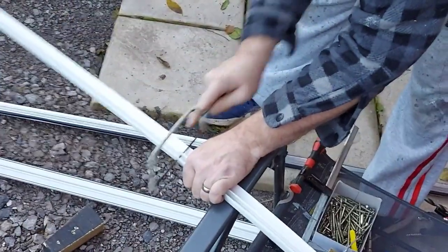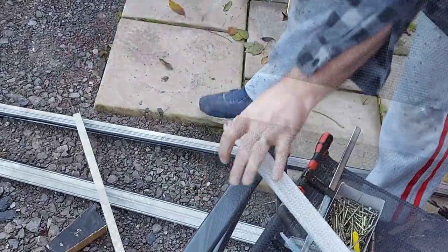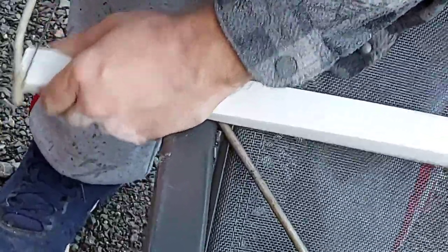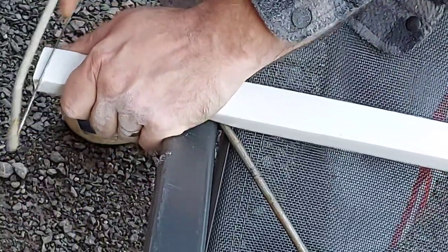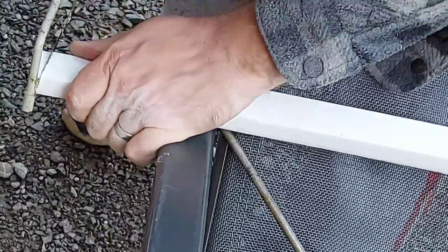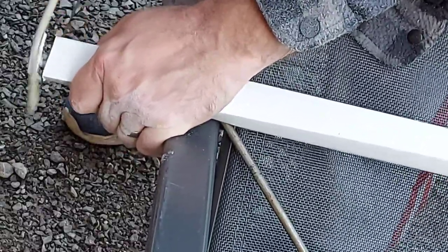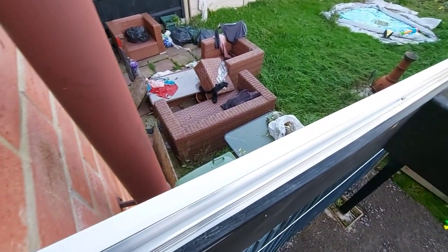Right, so I've fitted the rightmost aluminium glazing bar track. And here I'm cutting down the side F profile trim. Because it's partially against the side of the neighbour's house and partially clear of the house, this has to go in two sections. One part of the F profile goes upside down, and then the flashing is put over the top of it, and the bit that's towards the front goes the other way round.